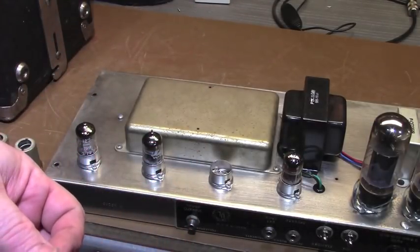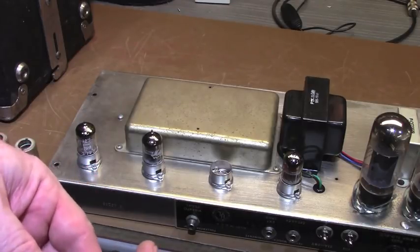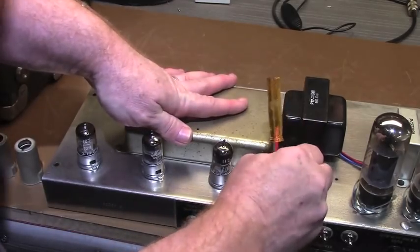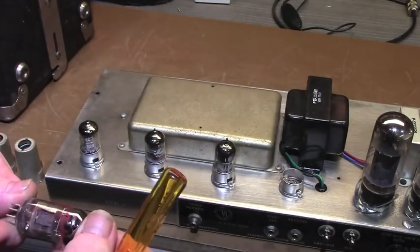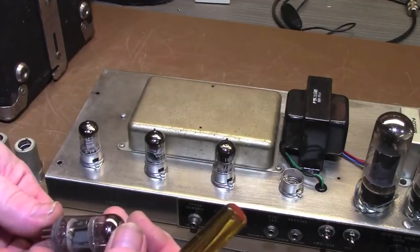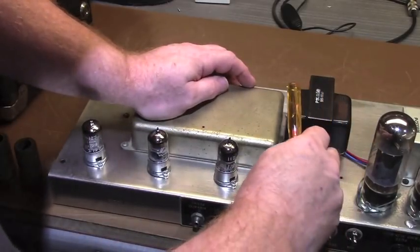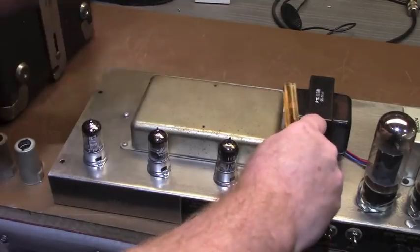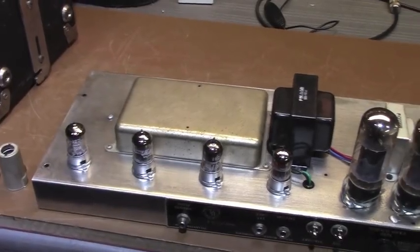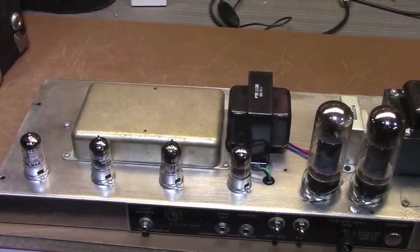V3 looks like, yeah, it's a Sovtek 12AX7WA, also 31609. It's got my little rating on it there. And then V4 is a Fender branded 12AT7 rather, proper tube, with no numbers on it, so I never tested this tube. It might have been added later. A lot can happen in 9 years, so you know, it's possible that things may have gone differently since it was here last. Let's pop open the cap can and see if I can remember what I did in there.